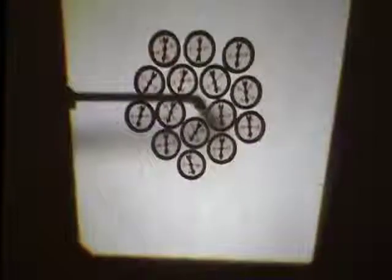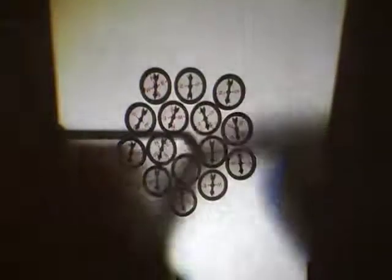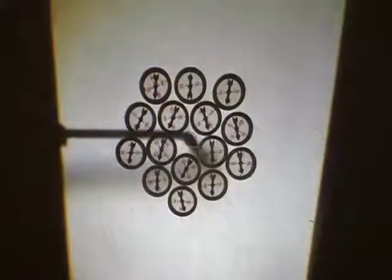Even, because I don't want to set this up again, this guy. Hello. Got a little compass needles around this. Look here, not up there. You see this wire that comes up vertically? Moving charges is the source of all magnetism, correct? You know that now. So we can have individual charges moving. What if they're flowing through something? Current. Current is a flow of charge.